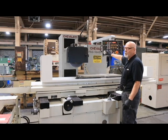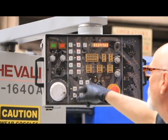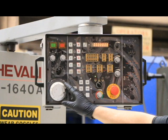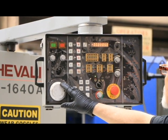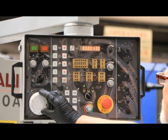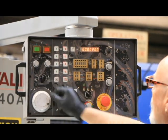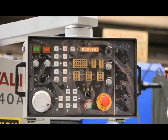You also have a manual pulse generator here. When we go off of the hand, that would be used in the rapid modes or with these buttons. We go into the X over here and you can set this little digital readout up there to zero. You can see each click of the dial is giving you one tenth. When we go to this one, it's giving you one thousandth. Each turn is one thousandth. So you have a one tenth and one thousandth increment on this manual pulse generator.